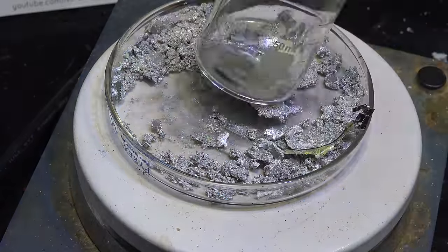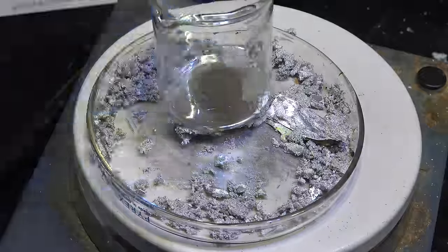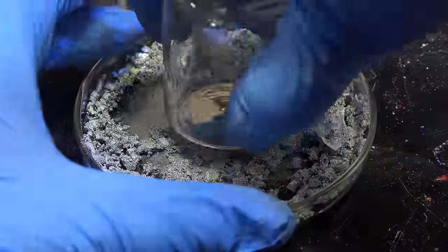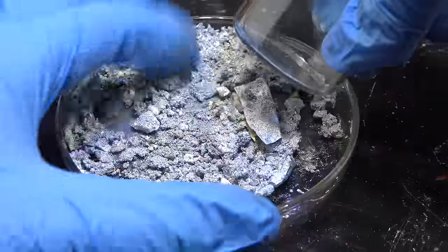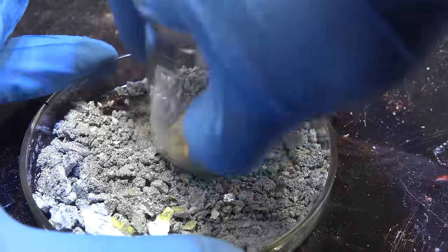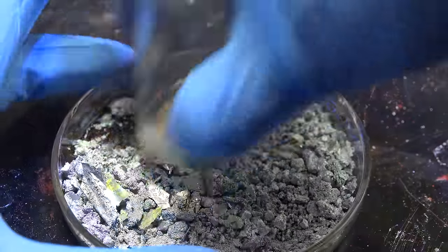Even worse, the molten gallium makes them aggregate back together again the more I work it. We can encourage it to break apart by cooling it down. Without molten gallium, the pieces can't stick together. The aggregates are considerably weaker, so even though it's cold, it's still easy to crush them. Nonetheless, the particles aren't as fine as commercial aluminum powder and large uncrushable chunks remain.